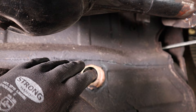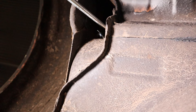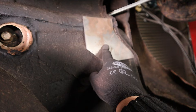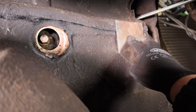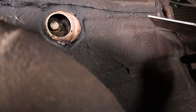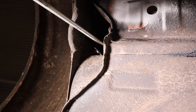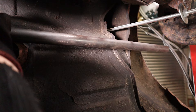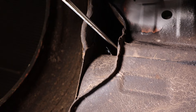It's all calculatable, but of course it is making stuff not easier. I made some plates that will fit right here - and of course one on the other side as well. These are just some spreading plates that I'm going to weld or bolt in. I think I'm going to bolt it in first because we have some gravity issues here. And what I want to do is put a bar on top of that so I have a brace from side to side - I think that's the best thing I can do now.